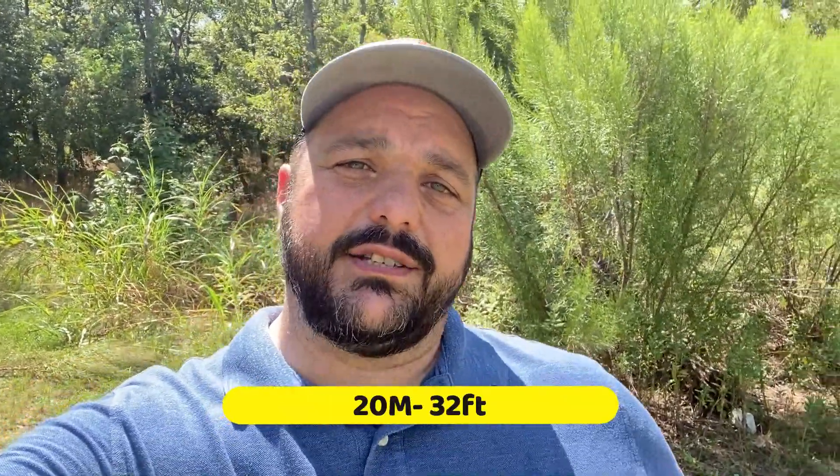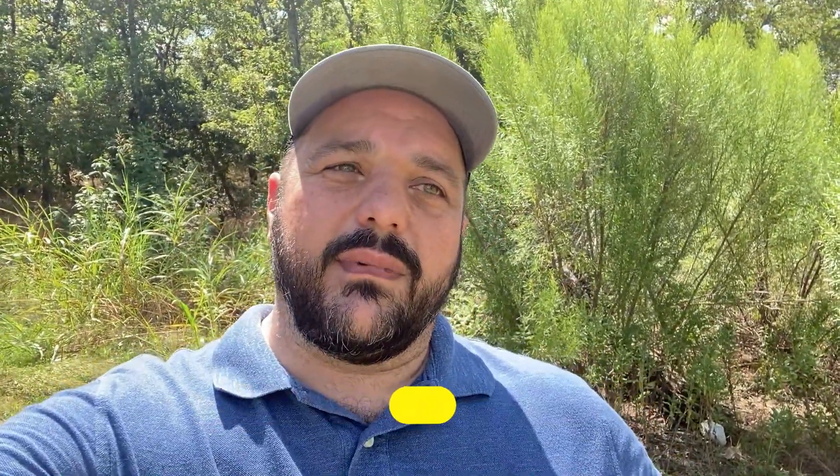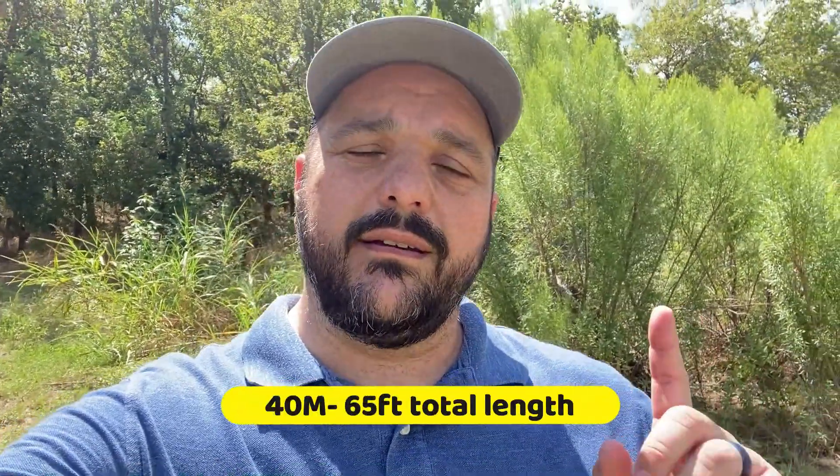And if you want to add an additional band — if you cut it for 20, you'll get 20 and 10 on the harmonics. If you want to add an additional 30 to 31 feet to the end-fed half-wave to make it a full half-wave of 40 meters, then you'll get 40, 20, 15, and 10. You get 4 bands by adding an additional 30 feet of wire.